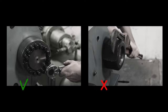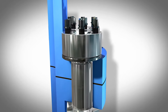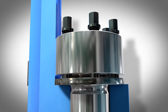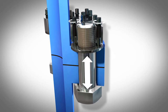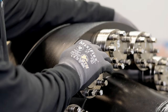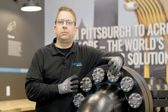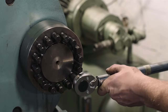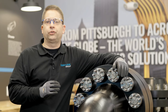The design revolves around taking the large torque, commonly associated with hex nuts, and dividing it among several smaller bolts called jackbolts contained within the Superbolt nut body. This was groundbreaking then and continues today as a go-to solution for mechanical tensioning of bolted joints in industry. This means even large bolts can be tightened easily in tension using low input torques with simple hand tools, which makes everything much safer and easier to use.